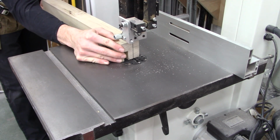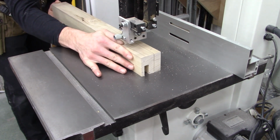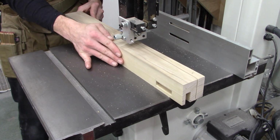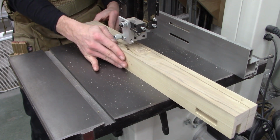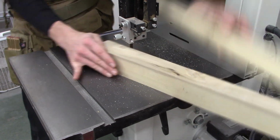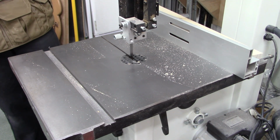After all the joinery is cut in the legs, I'm moving on to putting that reverse taper in the legs. It starts out as removing 3/4 of material from the very top, and then removing none at the very bottom, going to the edge here. So there's many ways to do this. My tapering jig wouldn't work with this thick a stock, so I went to the bandsaw and did a rough cut of the taper first.